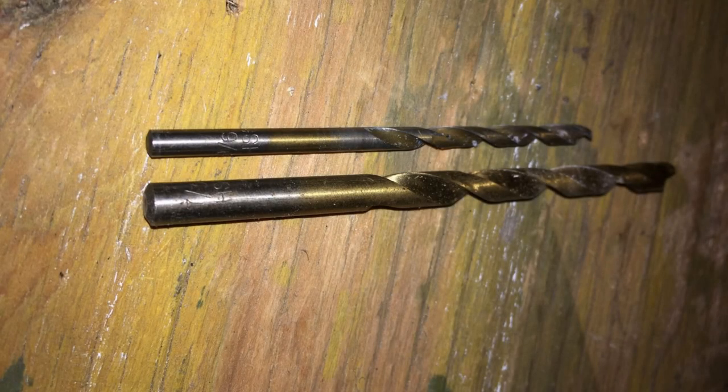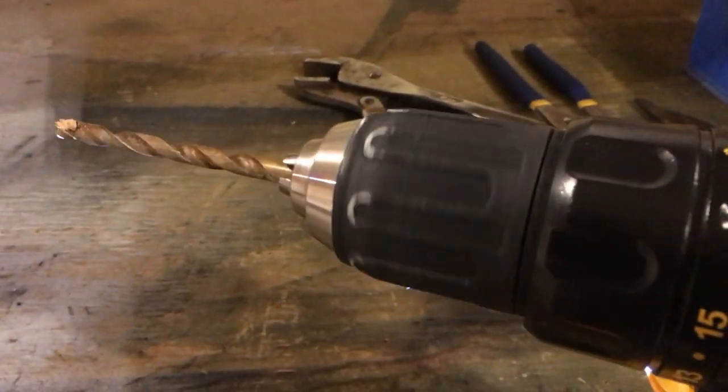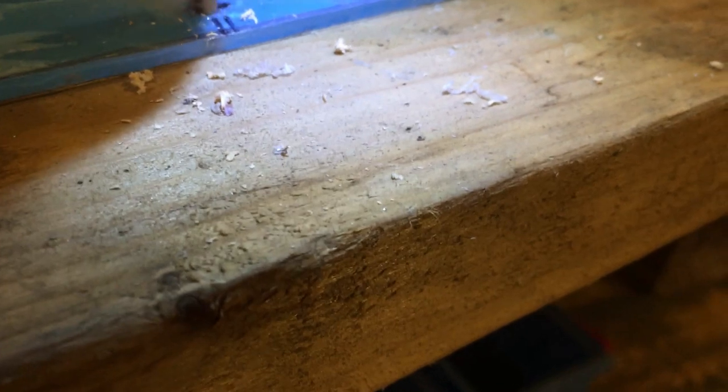Two separate drill bits were used, one for the threads for the aluminum, and one to clear the shank and the threads for the plexiglass. For plexiglass, first run the drill backwards, never exceeding the weight of the drill as far as pressure goes. Then finish it by running forward.